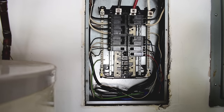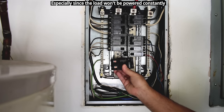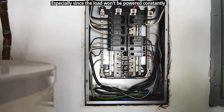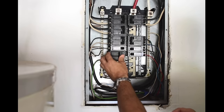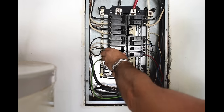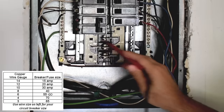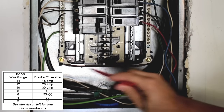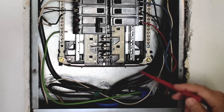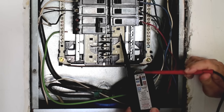The heating unit is rated 42 amps. It's a resistive load, not an inductive load. So I could get by using a double-50 breaker, but instead I'm going to be using a double-60 along with a 6-3 Romex cable. In case you're wondering, each one of these bus bars is 120 volts. This right here is your neutral — it's bonded to the panel, and that's where the ground wires are connected as well as the neutral wires. If I connect this here and touch to that, you can see 120 showing up.